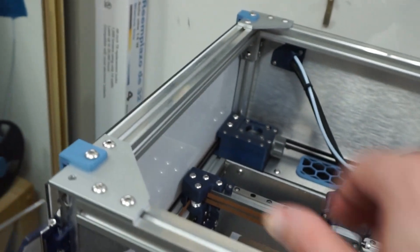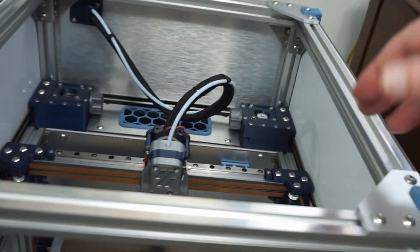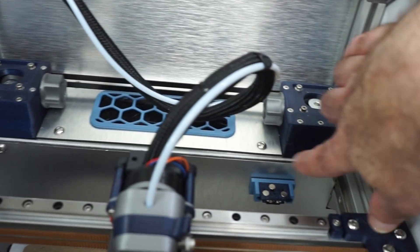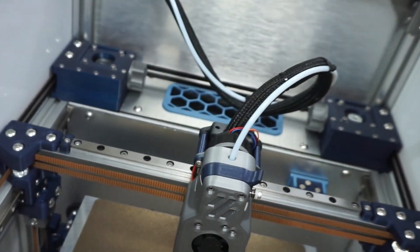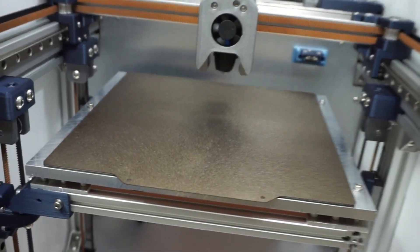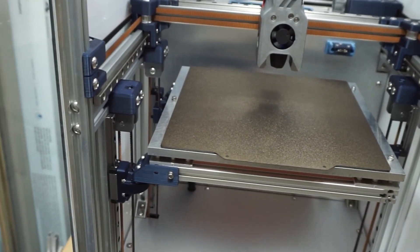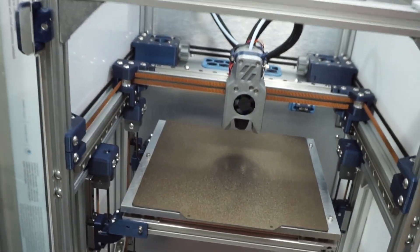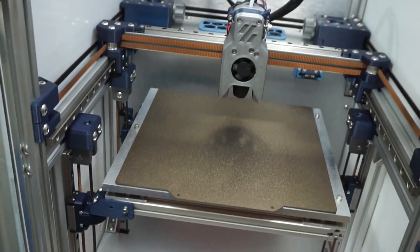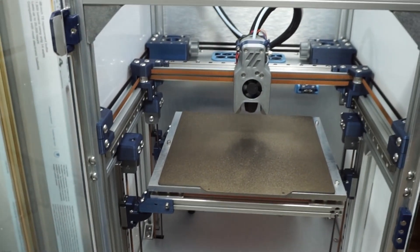On my GitHub version I've slightly updated the frame size — I made the front-to-back extrusions 10 millimeters longer to make it easier to add accessories to the back and give a little more room. It works as-is but it's pretty tight, so the new model has 10 millimeters more depth for clearance or additional mounts.